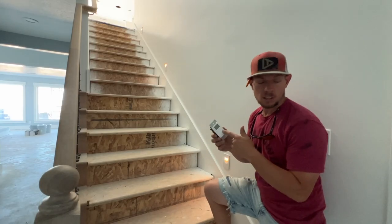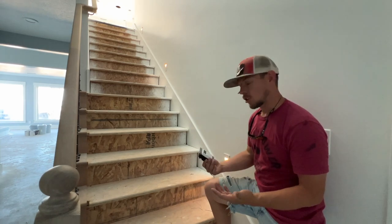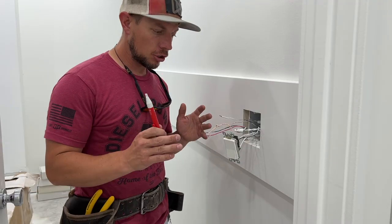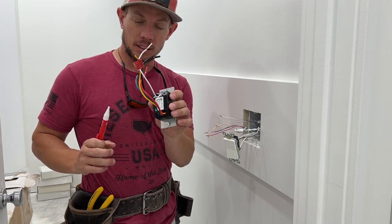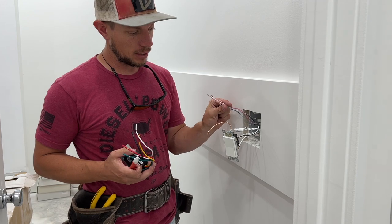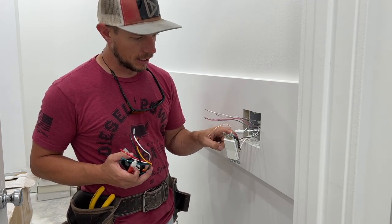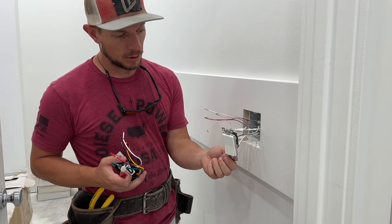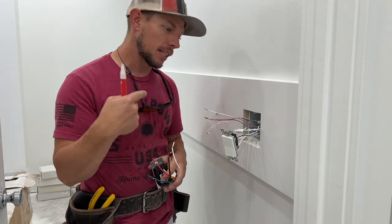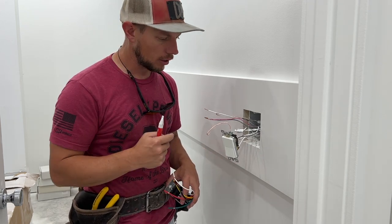You can buy similar switches at a box store. They are very expensive, and I've gone to the trouble of finding them for a good deal online, and I will link them down in the description. I'm going to show you how to hook up that three-way switch that's a little bit crazy looking. These are the wires I'm going to be using to hook up this, and this white — these are my neutrals. See how they're all bound together in this box? Because a typical light switch doesn't require the neutral. A light switch is just interrupting power, so the neutrals are all the way set in the box for that light already.